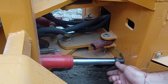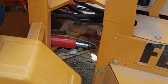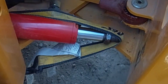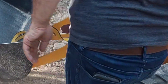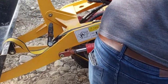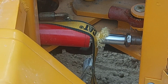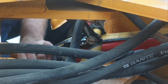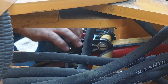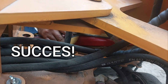The piston is not moving, so I need to use some type of strap to pull it back. Our first attempt was to connect the strap to the bucket, but we didn't succeed because the cylinder pierced through the strap. The second attempt worked — my husband had to take out the bolts of the cylinder without removing it from its location, because we didn't want to mess with the hydraulic hoses.